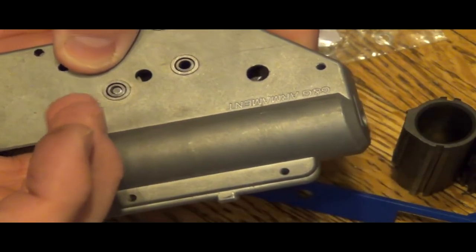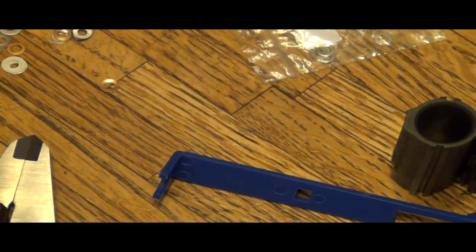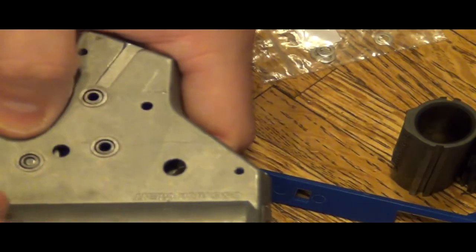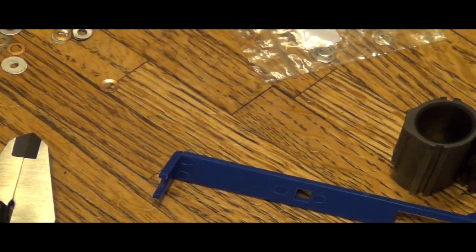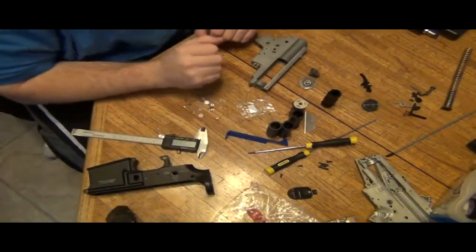Okay, so that can't move up. Like I was thinking 0.2 is what we need, so I'm gonna go ahead and take that other one off. Check it. Comes up the tiniest bit. So once I screw that down, that should be really close to being already shimmed. So the sector gear is practically already shimmed, and we're going to need to check that work pretty soon.